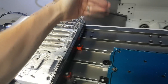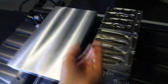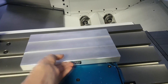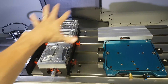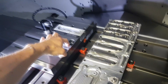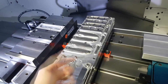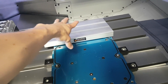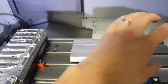The orange vise works really well for me because I have 20 inches of Y — just over 20 inches — so I can put them like this, whereas this pallet I'm going to end up putting sideways. So I can still use my vacuum pallet. Those pallets come off super easy. It's going to be a nice workflow. Right now I've got the orange vise as a vise setup — I typically use this a lot with the combo jaws. I've got a full pallet here, and I can easily put two full pallets on either side. So I have that, I have the foam vacuum pallet, and I have the Pearson pallets. I don't exactly know what I'm going to put on them yet, but I have a lot of products coming up that I will need fixture plates for, so I'm super excited for that.